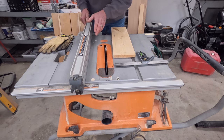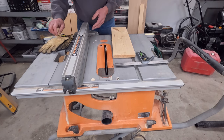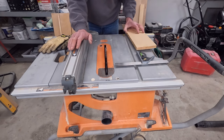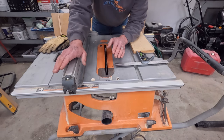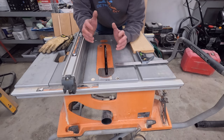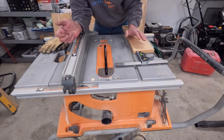Next, make sure that your fence is parallel to your miter slot. Move your fence right over to the miter slot and lock it in place. My miter slot is just protruding enough for my thumbnail to catch it, and it's the same here, so I know my fence and blade are good. If yours are not, go to your owner's manual — there are ways to adjust the fence and blade. Even a brand new saw out of the box should be checked, as misalignment can cause a kickback.